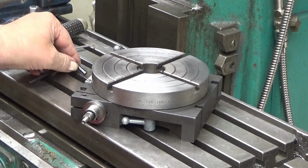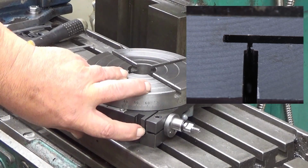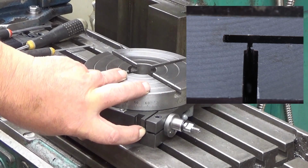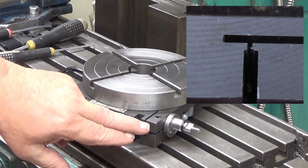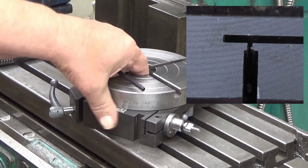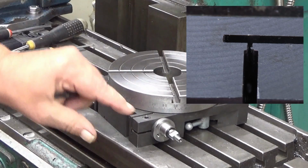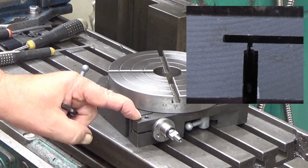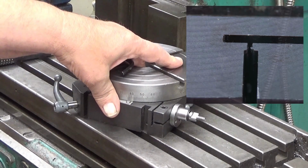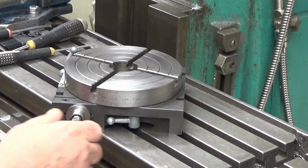Now, the reason, and I will show a photo, it's this corner here. They left a little ridge here. I don't know why, maybe they didn't have a suitable slitting saw or something, but they didn't mill it. This piece here is now loose, so that when I tighten this screw, it will actually tighten it. But earlier there was a 2 millimeter wide ridge here, which prevented it from tightening. I don't understand why they left it there, but there it was.